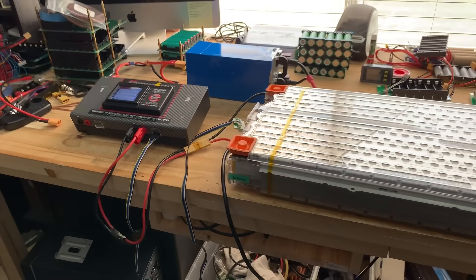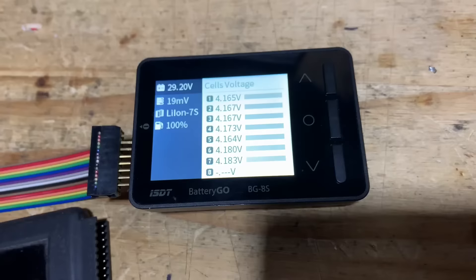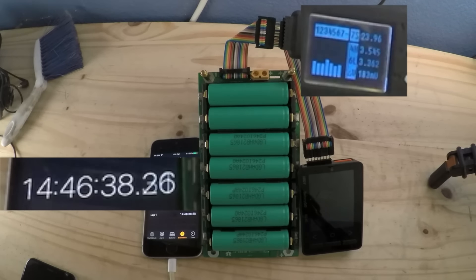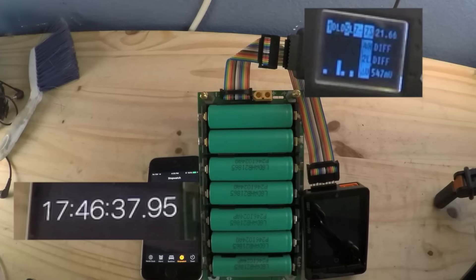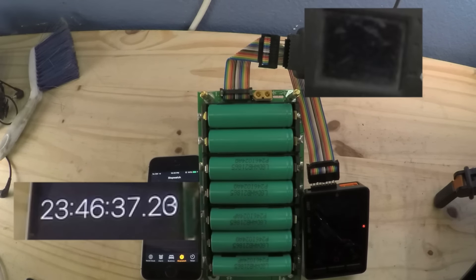The fans were turning on, now they're ramping down. These things are like tanks — you can probably get 50 amps out of it continuous, no problem. On 220V it'll do 80 amps maximum. So there you go — that's how you build a cheap $50, 1,600 watt — or 2,000 watt if you give it 220 volts — power supply. And this is how you isolate them and connect them with the Y connector.